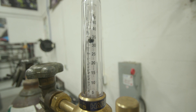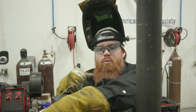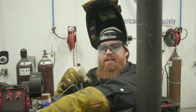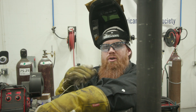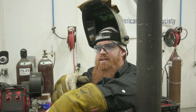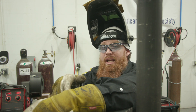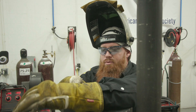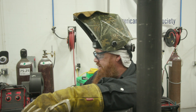We're going to run 90-10 gas mix — 90% argon, 10% CO2. Anytime you want to get into an actual spray transfer, be it regular spray or pulse spray, you need a concentration of 82% argon or higher. The remaining balance can be made up of CO2 or oxygen. There are many different mixes out there — 85-15, 90-10, 98-2, 95-5. For today we're just going to use 90-10. That'll be guaranteed to get us into a spray transfer, pulse spray because of the machine.